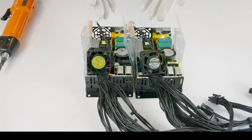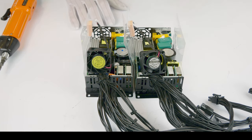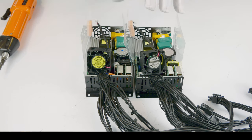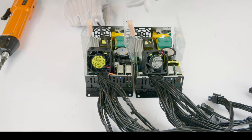If we then apply a fluid dynamic bearing, which we know is quieter, you can kind of get the best of both worlds, but it is a little bit swings and roundabouts. There aren't that many FDB fans rolling around with availability. Then there's the other issue, even fewer will run at the lower 3 volt startup speed. So options are limited. There is one option though, and that's to run with a Noctua 40mm fan, but not a 12 volt DC one.